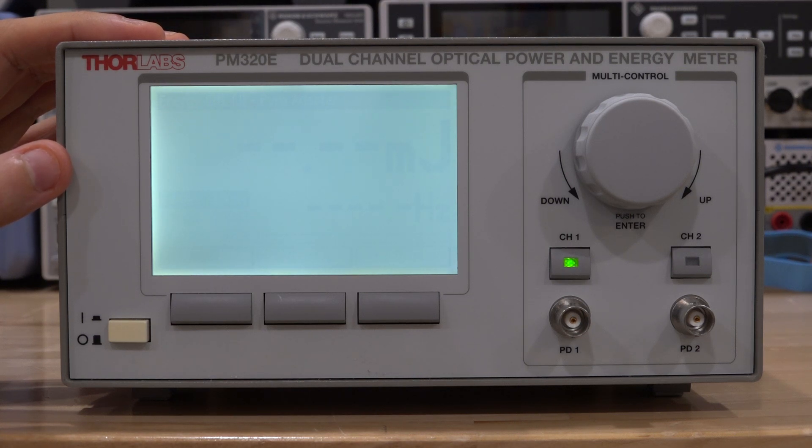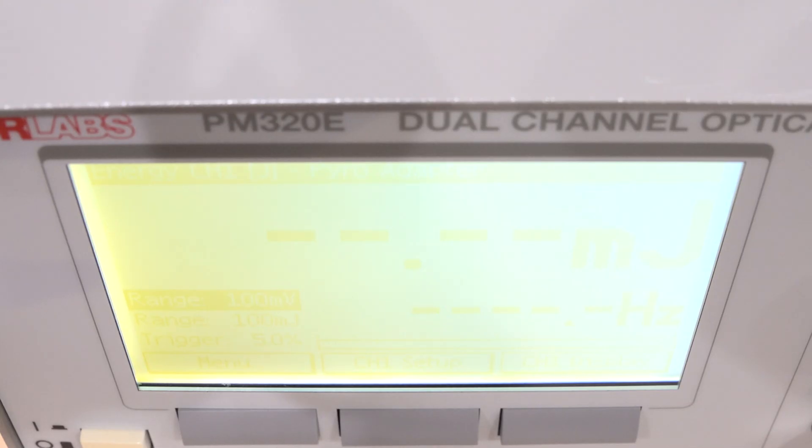Let's change the angle of the camera and look at the screen. Looking at sharp angles you can navigate the menus and find all the internal settings. There is a setting for display brightness but no setting for contrast. So this is not a case of someone having accidentally adjusted the contrast to one extreme — something else is going on. I couldn't fix it through the internal firmware.